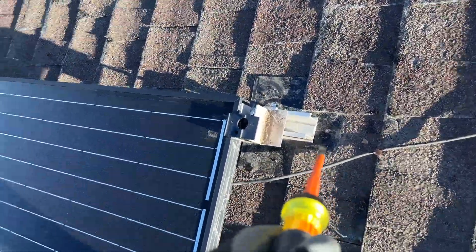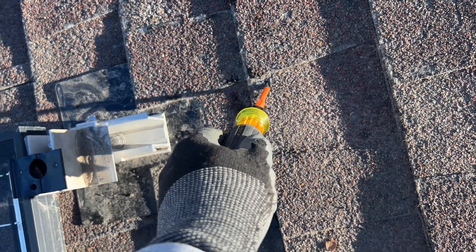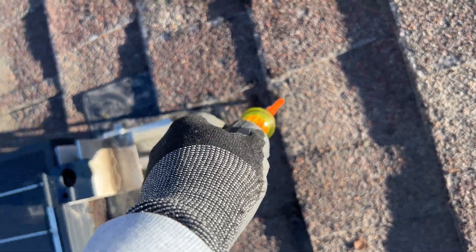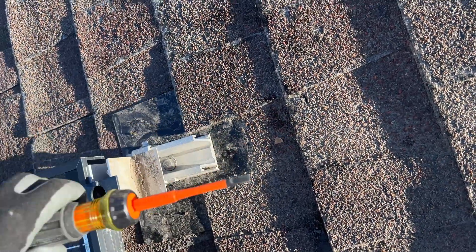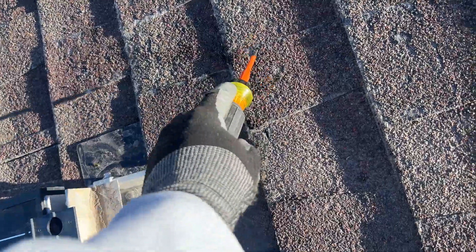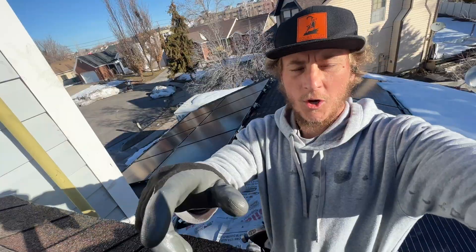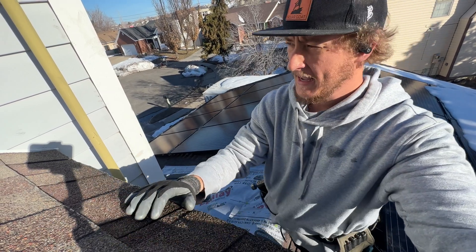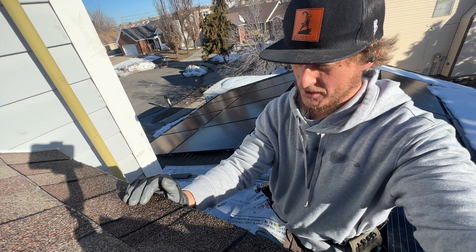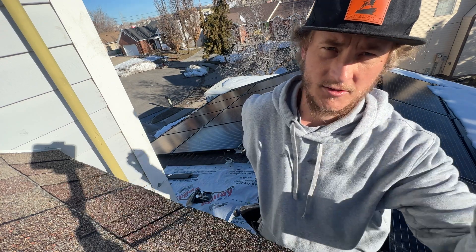Another thing I see is when they pry up shingles and damage the shingle — like right there, see that? That's a hole, and I don't think there's a flashing underneath that. When they're flashing it, they damage the shingle line when breaking it and pulling out nails to get the flashing under. Sometimes these shingles will blow off or be damaged and have potential holes on them. I've already turned the system off, which you do by flipping a DC toggle switch and turning the AC side off and then checking the voltage. This system is equipped with rapid shutdown — it's completely turned off, there's no electricity on the roof. So I'm going to start removing some panels and show you how I do it.